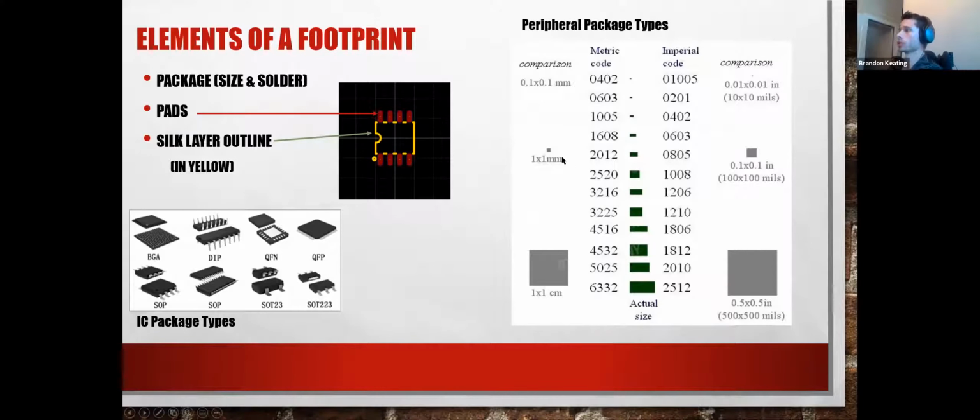So these are things that you would just pick your preference. It's not always preference. There are certain parameters, like if you have a resistor that's safe for power management and it's going to be dealing with a lot of voltage and current, you are probably going to have to use a larger package because you physically need more, not resistance, but tolerance, that it needs to be able to take a lot more punishment than a physically tinier resistor. Because with enough current, every resistor is going to act like a fuse. Eventually, they will explode. So size does matter.